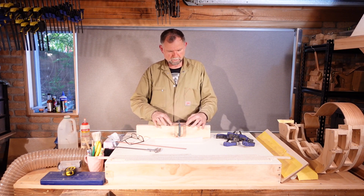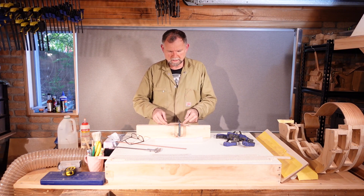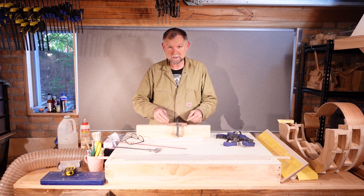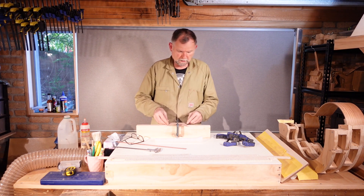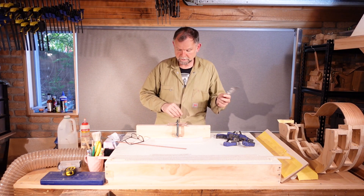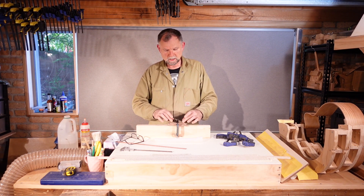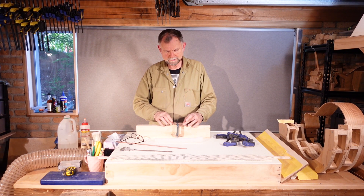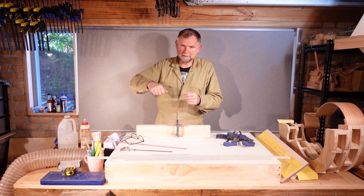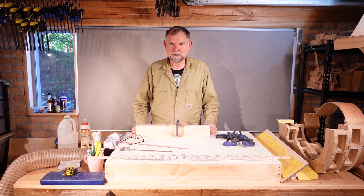I've clamped the two top and bottom curved pieces to the backing plate. That allows the centerpiece to slide in and be centered top and bottom. I've drawn two lines on the side, and I can measure in from the inside using the calipers. So what I'm going to do is glue the centerpiece in, then glue the top and bottom. We'll do the side pieces later. That will involve a little bit of excavating of squeeze-out with a chisel, but I don't think I'm going to be able to clamp it all together in one hit.